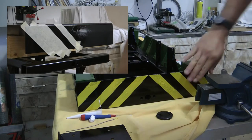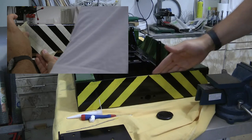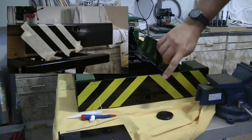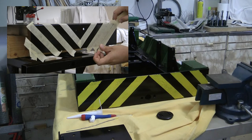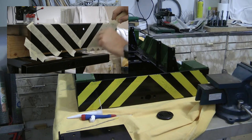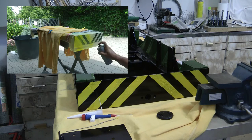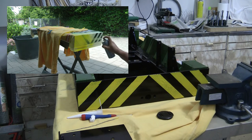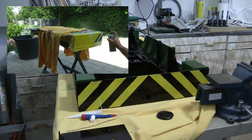The front got some nice chevron patterns. I must admit a mistake when selecting the paint — because in between the yellow and black there was more than a week, I'm pretty sure the black was dry enough, but the yellow paint was a different solvent type. So it started bubbling up the paint, which doesn't really look nice. But I left it as it is because now it looks like an old narrow gauge engine where the paint is crooked and some of the edges are wrong.